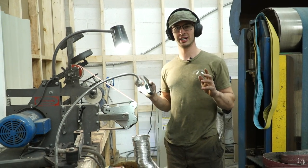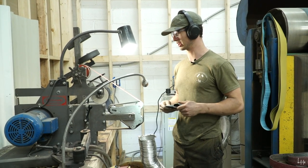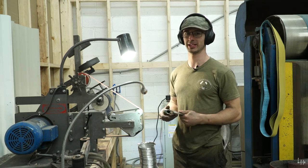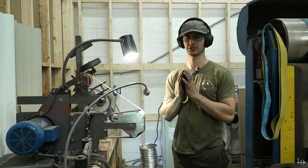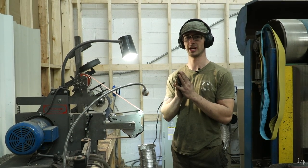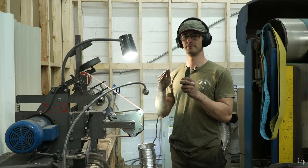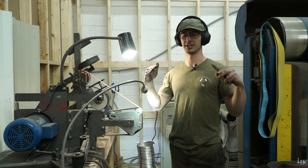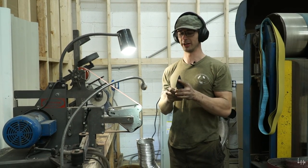Now that I've shown you my fancy three-step handle making process, I'm going to go into sharpening, and I will go a little bit more in-depth in sharpening than I did the handle making. Most wood cutting axes, your edge is going to have a convex grind on it. A convex grind is like a bird's beak grind. It looks like the profile of a bullet. It's the opposite of a hollow grind, which is a concave grind. Convex is rounded on the outside.